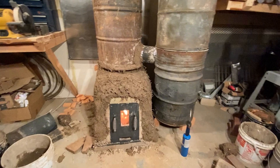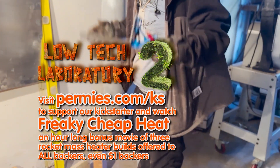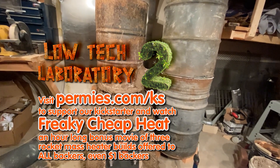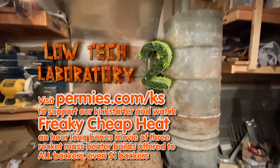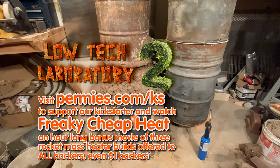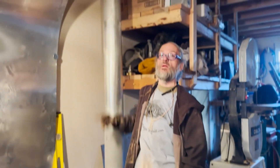The air goes up into a barrel, and from that barrel into another barrel, which I drew on the floor here. This barrel here is about yay high. It gets filled with the hot gases, and those hot gases radiate heat through the barrel into the room, clear down there, keeping them toasty — clear line of sight. The cooler gases sink down and get sucked out a hole over here, up this chimney and out.